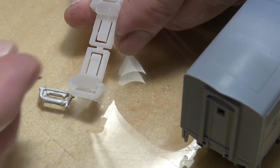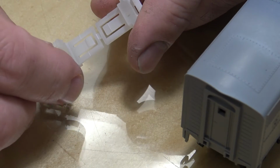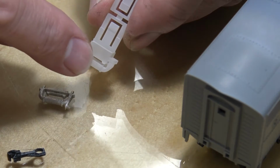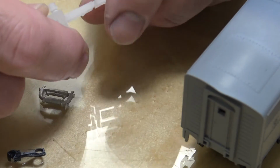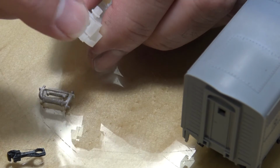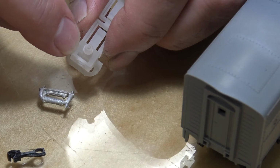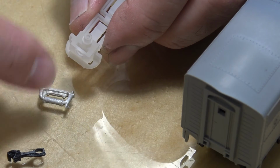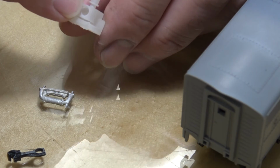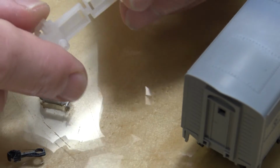Now, this is a coupler, should just slip right through there. Now I put it as far back as I could. Now this one is designed for a short shank coupler, but I don't have one up here. I forgot to get one out real quick. But anyway, what this is on the back, that's the coupler pin. So you'll see there's a hole in the bottom. You put your coupler in, you put your pin in, and there's enough meat in this draft gearbox that I'll just thread it with a 080 tap. I'll go up and I'll drill it. It's got a little tiny pilot hole in there, and then I'll drill it for a 080 and then tap it. So that's the new draft gearbox.